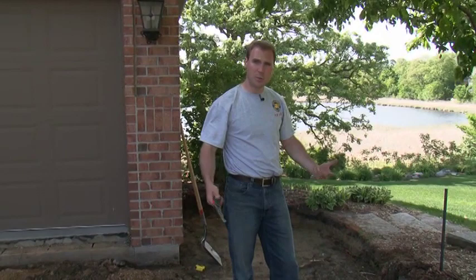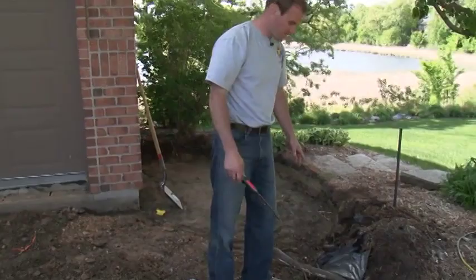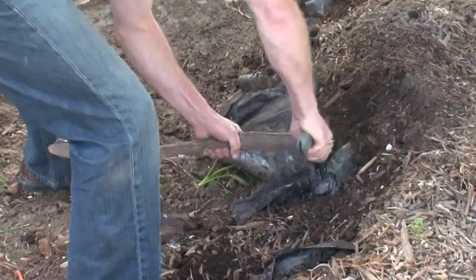In order not to damage this tree, instead of coming in here with a bobcat bucket or a shovel edge, we're going to take a pruning saw and trim back any large roots that are sticking out. A pruning saw is preferred over a bobcat bucket or a flat shovel for trimming back tree roots, as this will help eliminate damage to the vascular system of the tree.